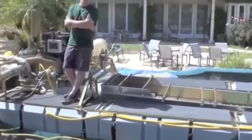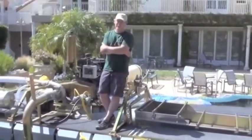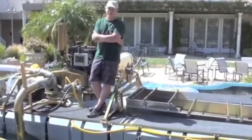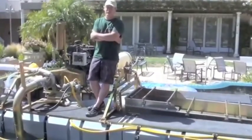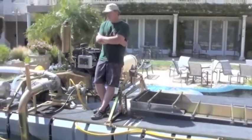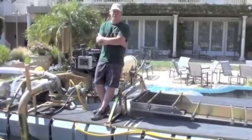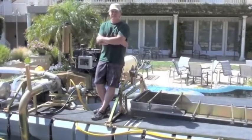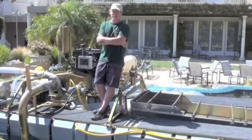I had to add additional flotation to the dredge to accommodate the engine. The engine weighs around 500 pounds or so, but it's still several hundred pounds lighter than most of the other diesel engines in its horsepower class. I'm going to show you how to prime the pump, how to start the engine, and how to run some of the basic components on the machine.